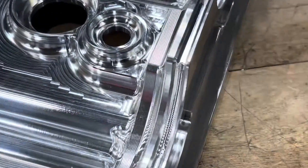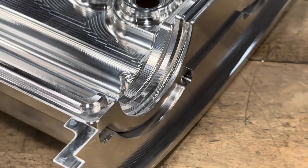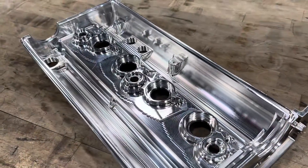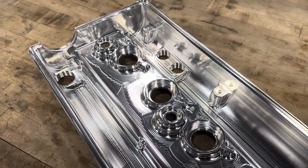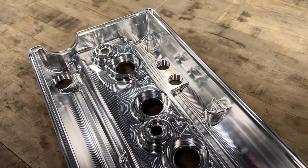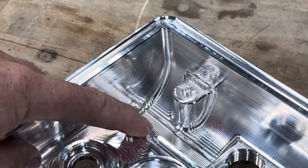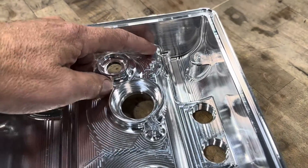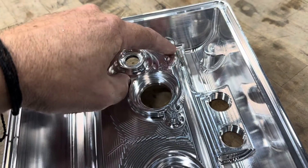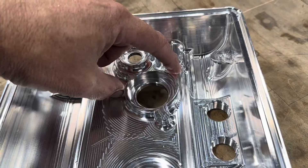Looking at the gasket groove on the inside, I'm really happy with the waterline tool path that surfaced it, and I'm not going to change that. One thing that's tough to catch in simulation is the opportunity for burrs to be left on edges — for example, surfacing along the edges sometimes kicks up a burr on the top edge, which is exactly what happened here. I'm either going to add a bigger chamfer on that edge that the ball nose can surface, or go back in with a chamfering tool and just chamfer that edge by creating geometry that follows the curve.